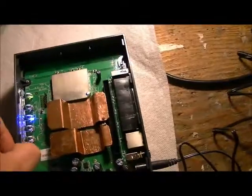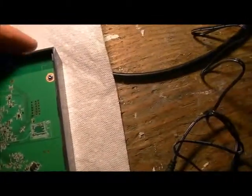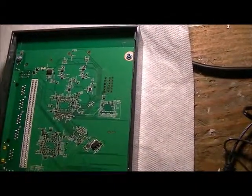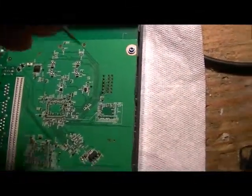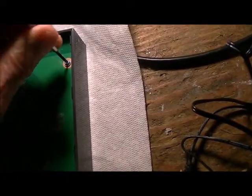Next, I'm going to flip it over, remove the four screws, and drill out the ventilation holes both on the top and on the bottom to improve ventilation and keep it cool. In order to drill the holes I'll remove the four screws on the circuit board and take out the circuit board. This unit uses Torx screws and I don't have those, so I use a plain jewelry screwdriver of the right size that fits to remove the screws.